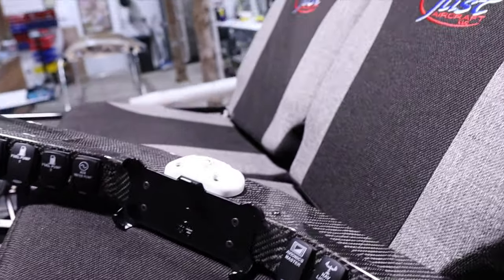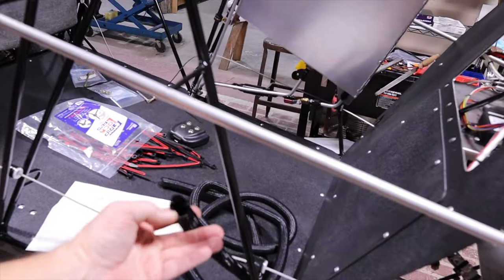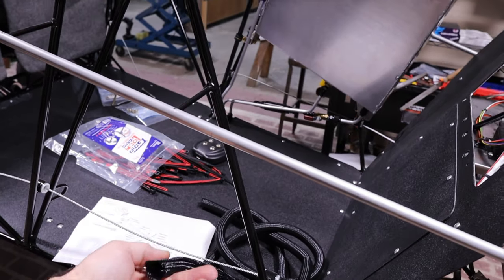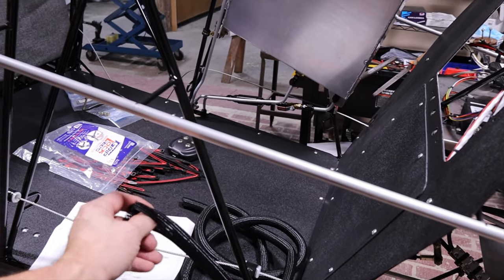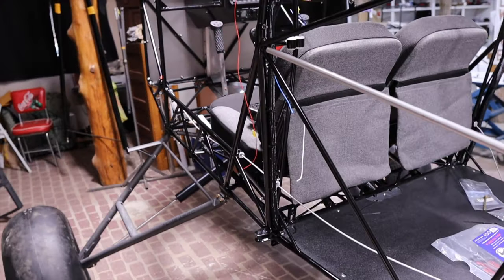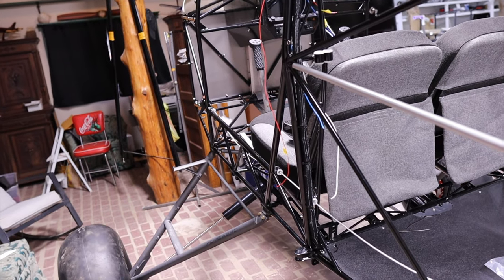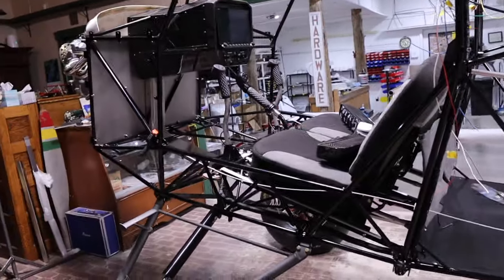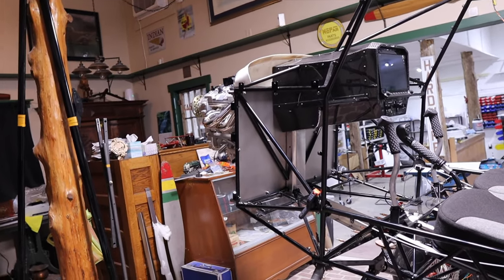The only other thing people might be interested in — this was made by Holley and it's just called a split loom. It's nice sturdy stuff. I went with three-quarter inch; I could have gone with half-inch, but where it's really handy is covering a harness that has multiple wire trees branching off everywhere. When you're wiring these things you're adding wires and changing stuff until you're done — this is a great way to add loom after you're finished without destroying everything you've already put together. I really wished I would have made it to Oshkosh. I heard everybody had a great time, but hopefully I'll see you guys in the near future.